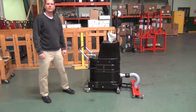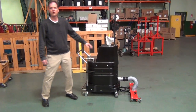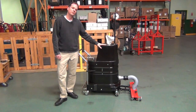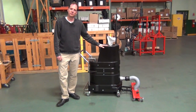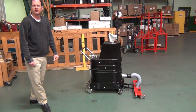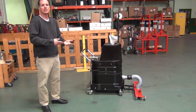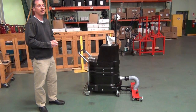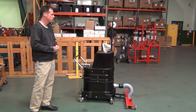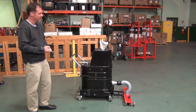Today we're reviewing the Ruvox AV-2000, a custom-made version specifically for the steel industry so you can pick up steel shot after you've blasted steel tanks. Normally the procedure is you blast the steel tanks, blow it down, get all the material down to the bottom, clean that up the best you can, and then do a final vacuuming prior to putting down the paint. This vacuum is going to allow you to do that.